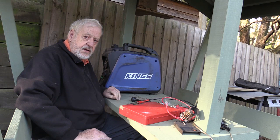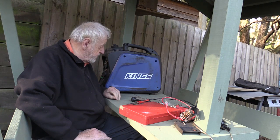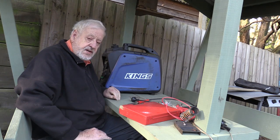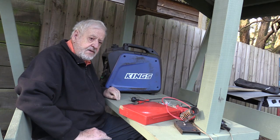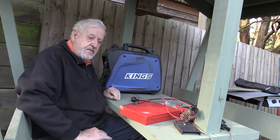It could raise serious questions of whether or not it meets the regulations. It needs a fair bit of work done to it. S9 to S10, S12 is just unworkable for HF radio. So if you're using the 737 network or amateur radio when you're out in the bush and the generator's just wiping out everything and you can't hear anything, this may be a solution for you. It's not particularly expensive, just a lot of fiddly mucking around.